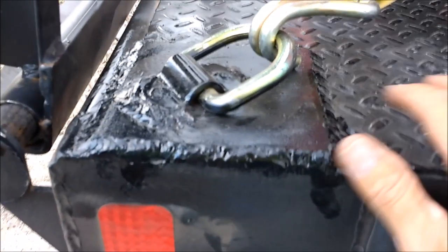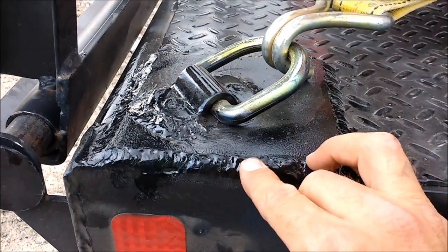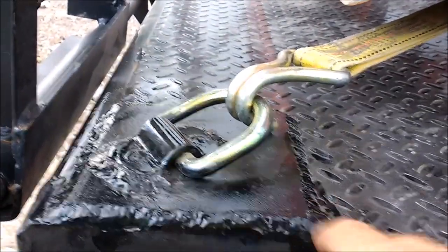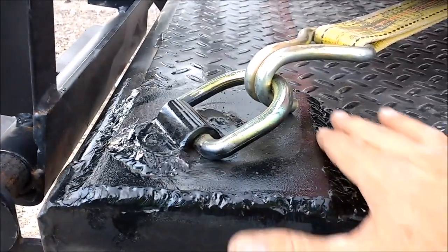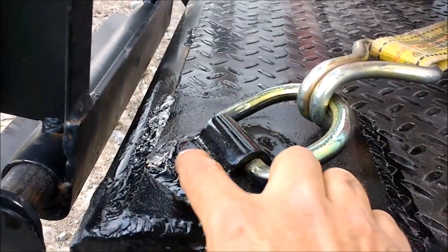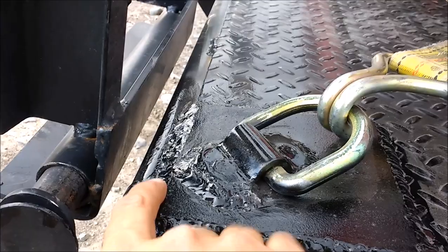The back ones I welded using the PrimeWeld multi-process unit in arc/stick mode, making several passes. I used 7018s here and 6013s on another one on my buddy's advice — I tried the 6013 rods and I like those as well. I got good penetration with multiple passes, so I feel good about the strength. I welded these bolt holes with the MIG welder since it was easier to get wire in there and generate heat compared to trying it with stick.